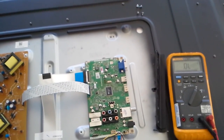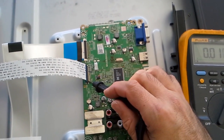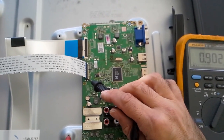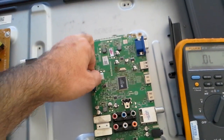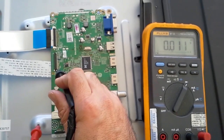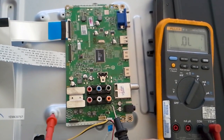A few things you want to see is first, one problem we have seen with that board is a low resistance level, which is what is making that board power cycle. It has 11 ohms and should be way more between chassis ground and the power that it takes from the main, the standby power. I think it was 24 volts or 21 or whatever it was. If we disconnect that, that resistance is still going to be here. I believe the first few pins are like that. And there is a problem on that board that causes that short. It is addressed in our repair kit. We give you the component that we've seen a few times short out and the location for it.